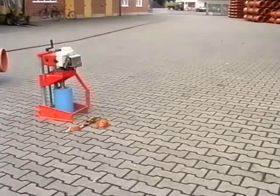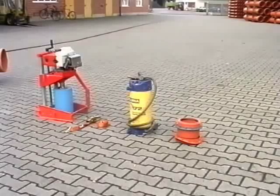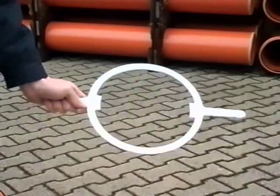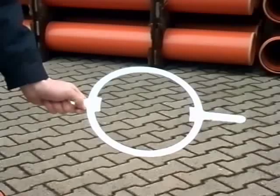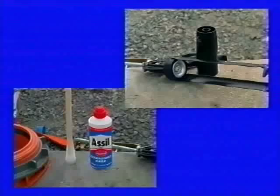You will need a core drill with clamping strap and cooling water feed. The saddle, if required, with a sealing cap, a tool to tighten the nuts, lubricant, an expansion resin and a cartridge gun with a special distance piece.